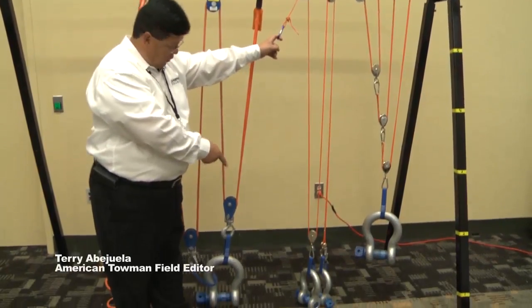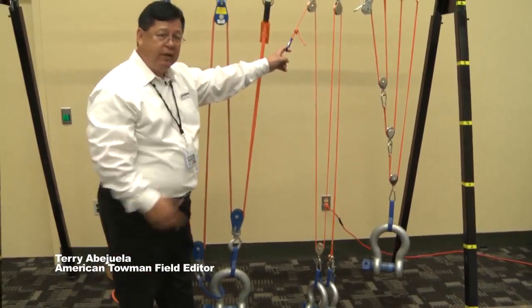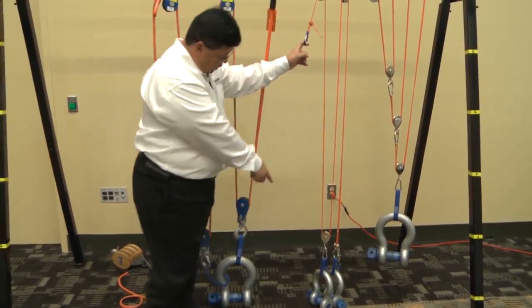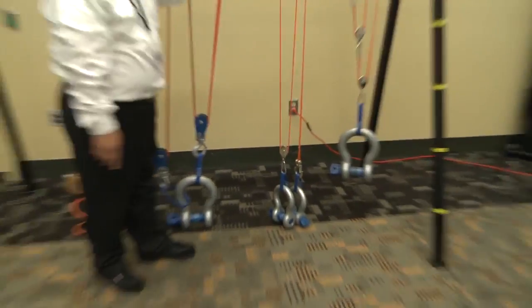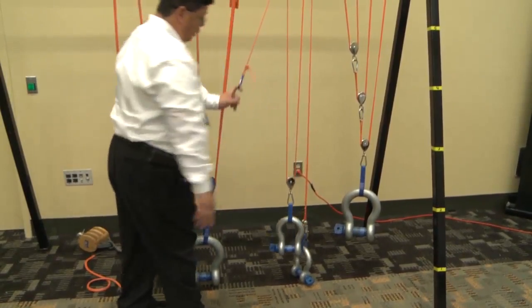You must determine line tension and how much load is on the block — key factors in being able to predict what is going to happen when you pull on the load. In this example, I've got two shackles: one weighs 17 pounds and the other weighs 13 pounds. You might think the lighter one would move, but if you know about pulleys, this one shackle has two lines to the load, so it's double the effort. The heavier one is actually going to move instead of the lighter one, and I can predict that because I know how the pulley system works.